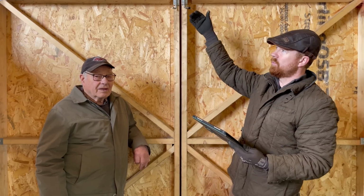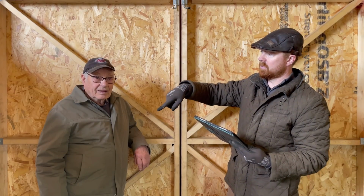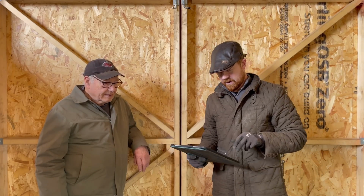We'll put drip boards on the roof as well, a drip board all the way along the front, so it runs into the gutter, and then the downpipe. We'll probably take the downpipe across to the drain, so the water will just run off the front into the drain. That was the plan all along.